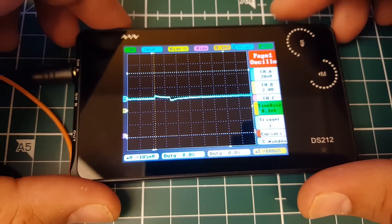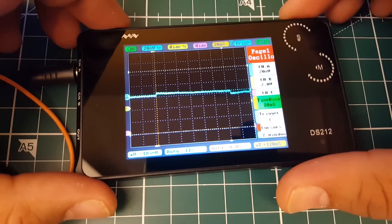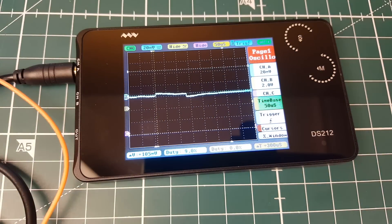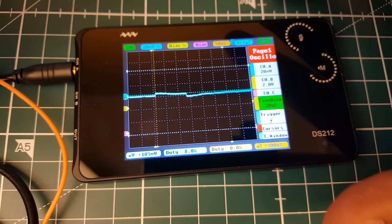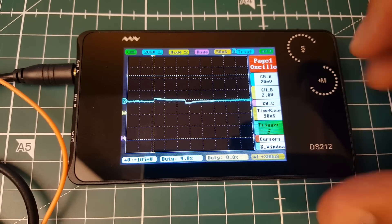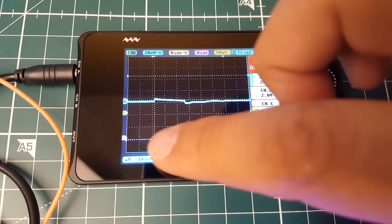This is the whole command right here, so let's zoom in. Each square is 20 microseconds and that's what it's taking to relay idle. I'll hit full throttle — going from zero to full, and there's the middle. It's actually working. I expected a little more resolution like on my bigger oscilloscope, but you're only paying a hundred dollars so you can't expect too much. It does have two triggers: rising edge and falling edge. We use rising edge because that's where our data starts.